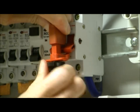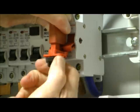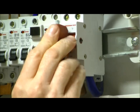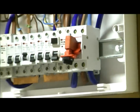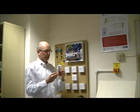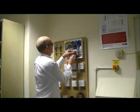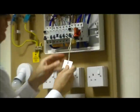As I say, the mechanisms come in various shapes and sizes. The main thing is that once it is in place it can't be removed and obviously prevents the switch from being operated. So there we have the isolating locking mechanism in place. We then apply the padlock with the suitable label — with, if necessary, the details on the label should anybody need to contact us while the installation is isolated. We then put the padlock through the lock.